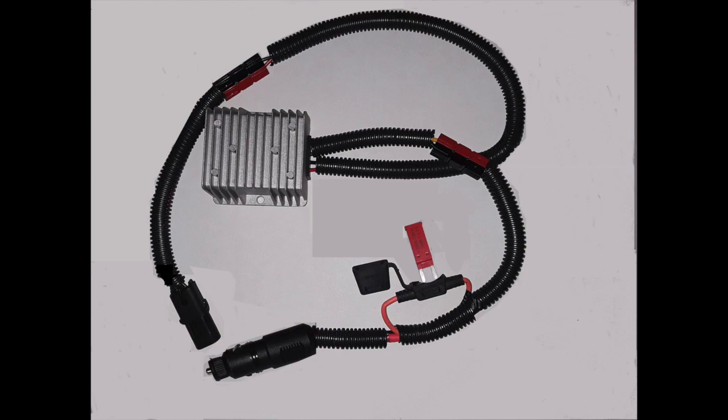Pictured here is the revised circuit with the new PTC installed, which quickly recovered after every reset, and the average current was nearly as good as the circuit without the PTC. But I soon discovered another issue, which was that the boost converter could be subject to a flow of current coming from the battery when the converter output voltage drops below 12.8 volts, which it would do when the PTC resistance increased sufficiently, thus lowering the voltage going to the charge controller. The solar panels don't have that problem because they have blocking diodes.